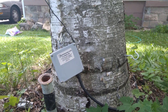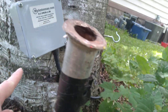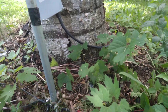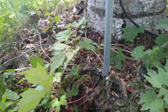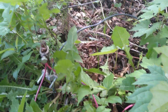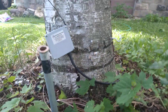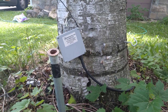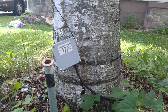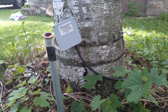Originally, how I had the setup here — at the grounding lug — I had it hooked up to ground radial wires and a ground rod. But I've seen on videos and read that you can also just use your coax as a counterpoise, as long as it's over about 15 to 16 feet.